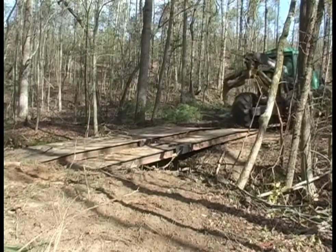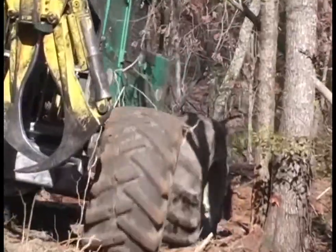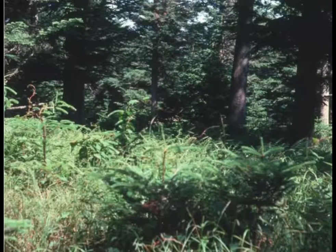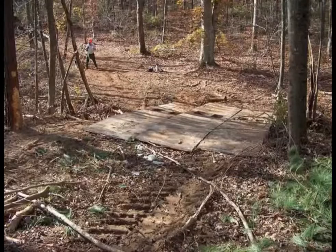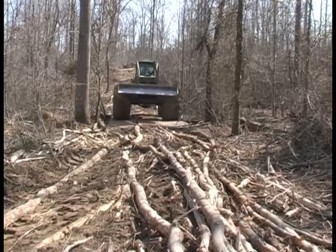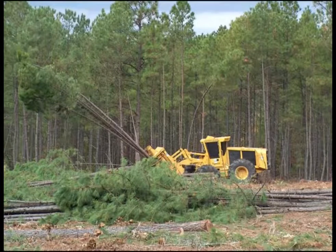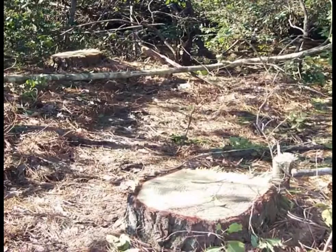When installing the mats, any kind of suitable equipment can be used, so long as it can get to the crossing location without damaging the ground or timber nearby. Since ground vegetation, brush, and tree roots help keep the soil from washing away, it is important to only clear out as small an area as needed to cross the stream or ditch. Remove just enough to securely set the bridge mats and provide enough clearance for your equipment and trucks. This may require having to cut stumps down almost flush with the ground, so the bridge mats and equipment have stable ground to rest on.